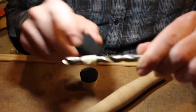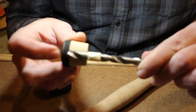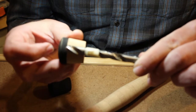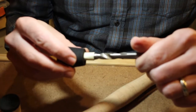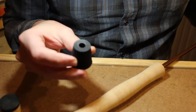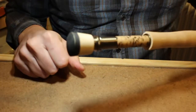So I always mark my drill bits — this one is kind of geared to this butt. I extend it as far into the fighting butt as I can get without there being any chance of it popping out the back. Once you have that tape in place as a guide, go ahead and chuck it up and drill out the bore on the back of that fighting butt, and you should be all set to mount it straight away like that.